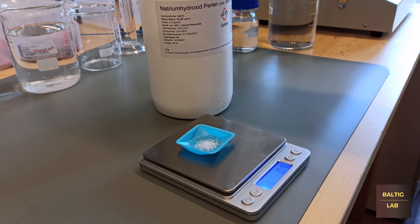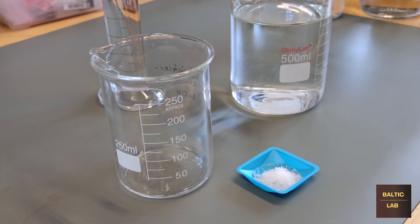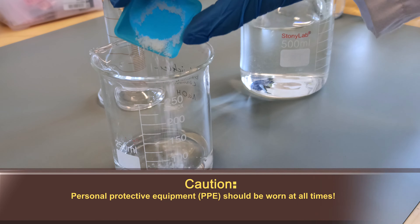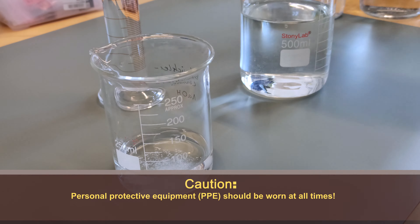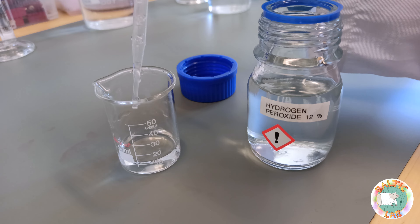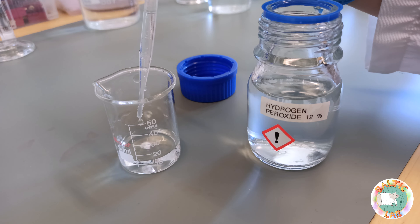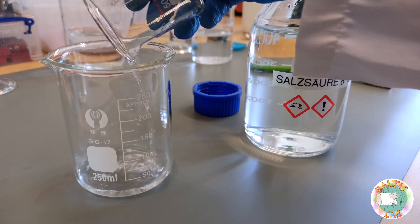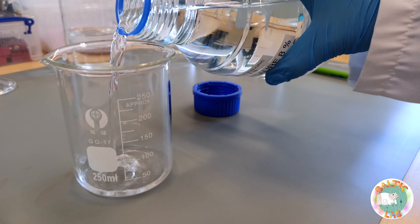I'm making quite liberal use of the word 'I' here because the person shown in the following footage is my research assistant. Not only did she patiently endure hours of filming, but she also developed all lab protocols involved in this process. The developer used is a fairly standard sodium hydroxide solution with a concentration of 10 grams sodium hydroxide per one liter of developer solution. My etchant of choice — since the day I ran out of sodium persulfate — is a mixture of 12% hydrogen peroxide and a very highly diluted 8% hydrochloric acid solution. If you're interested to learn more about this etchant, check the video description; I'll include a link to a previous video and a blog article outlining the exact mixture ratios.